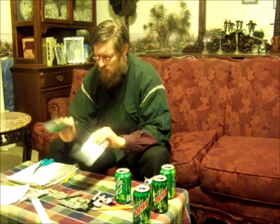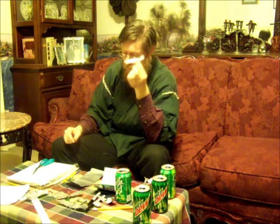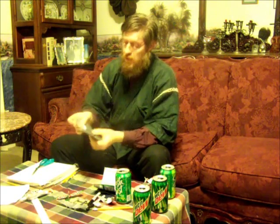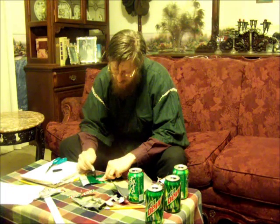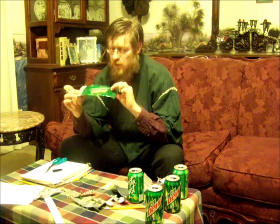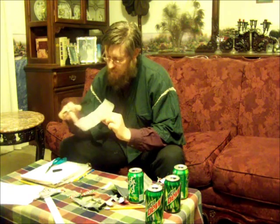After making your two sheets, the next thing you want to do is take the template that you've created. Take the fuselage first, lay it on your aluminum sheet, and then trace it out. You're going to be forming a pattern so that you want both sides, using the same one flipped over. I finished drawing my template onto my sheet. The reason I chose the center part was because it was free from the dents and creases around the edges.